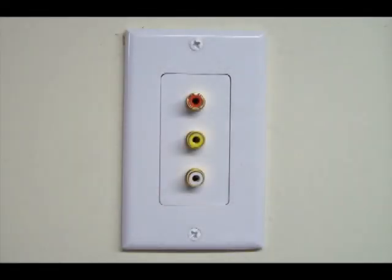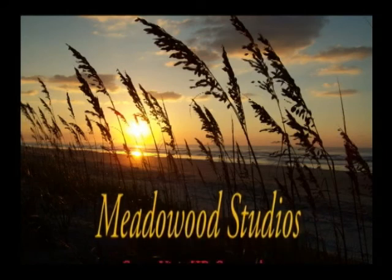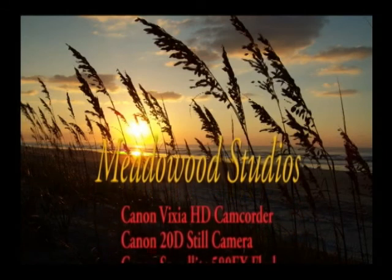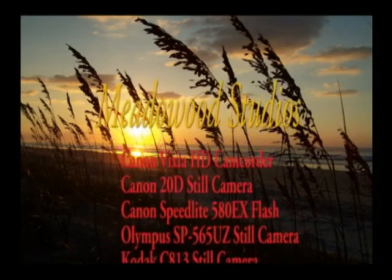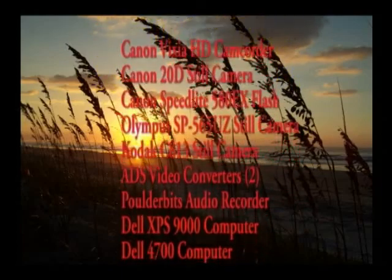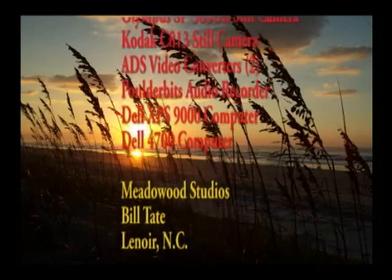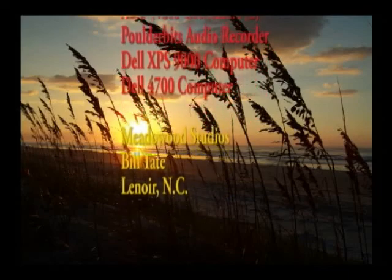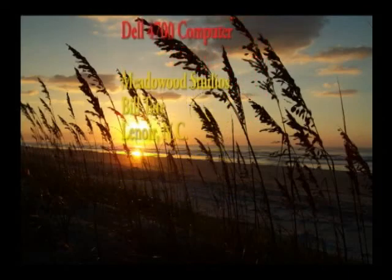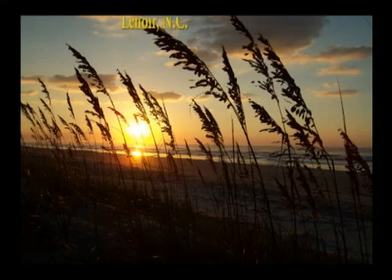Here is the finished product. I hope you've enjoyed this video and I hope it's been helpful to you. You may want to look at a book about construction and how walls are constructed before you start drilling for your wires — that is going to be by far the hardest thing to do, running your wires. It doesn't necessarily take special tools; you can use coat hangers, flashlights, and mirrors. Be careful in your attic — be sure not to step through the ceiling or accidentally drill through the ceiling somewhere. Take your time, take measurements, be precise, and be sure in what you do.